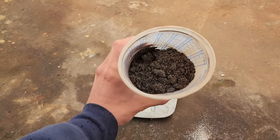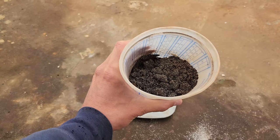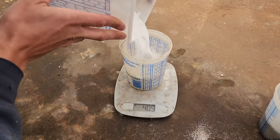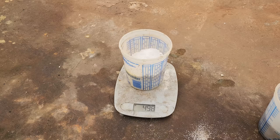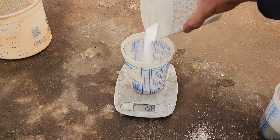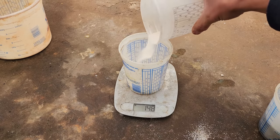Now we'll mix up a flux recipe. The goal is to eat up all the junk in here, leave just the precious metals. I'm going to add a collector metal to help collect all the little bits of gold down at the bottom. Here's our soda ash — I'm going to add about 500 grams. This is going to help dissolve any of those sulfides. I'm going to add some iron a little bit later to help break down those sulfides into a form that we can absorb with our flux. Now we'll do about 250 grams of anhydrous borax — this is going to help absorb any oxides. Then I'll add about 200 grams of silica because I figure we have at least 50 grams of silica in our material.